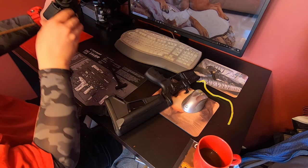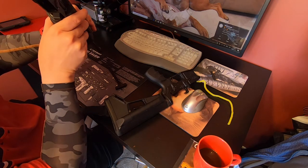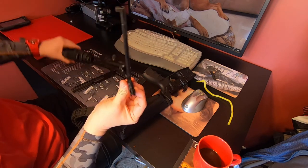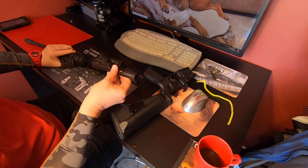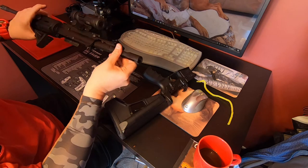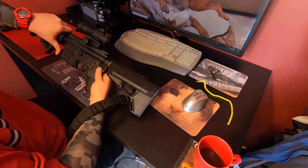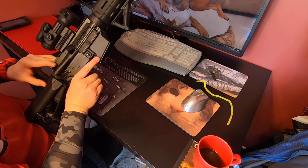Up front there's a nice feed ramp. I'm not sure if these are rated for full auto or not, but the gun's been really reliable. To put it back together: the charging handle slides into the little divot, the bolt carrier goes in with the gas key forward, slam it closed, then push the two takedown pins back in and you're good to go. It cycles fine.